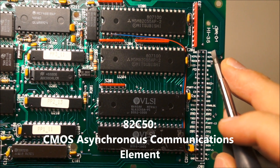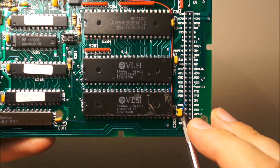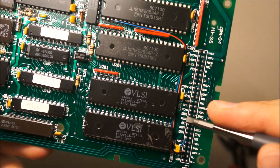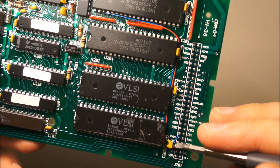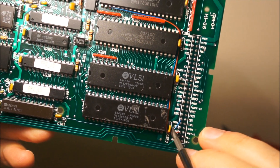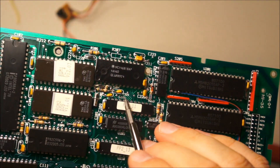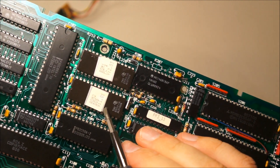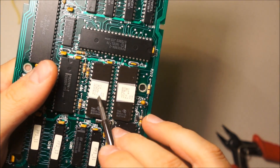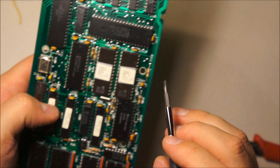Well that's interesting — look at that. They actually have a pinout. Why doesn't anyone do that anymore? We also have bodges. These are at least glued down. The bypass caps are through-hole but at least they actually have holes for them. Big resistor arrays. These are non-volatile memory — ROM 1, ROM 2. DOS version 1.01, version 2.03. I wonder if this has two various DOSs it can boot into.